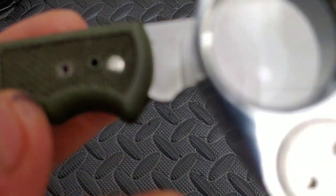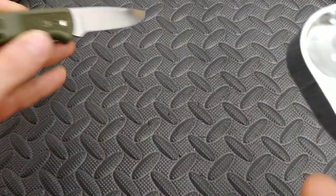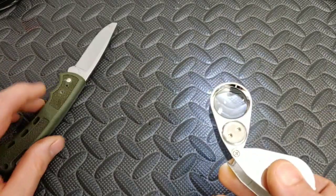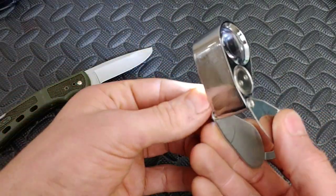What we're seeing there is a change in angle — that's from where I was showing something without holding an angle. There's also no good scratch pattern. You can turn on the light and see where the light hits one part of the edge and not the other — there's a shadow at the top. That's because there are two different angles there, so the light is reflecting off one angle and not the other. We'll look at a bit more and then move to a different knife.